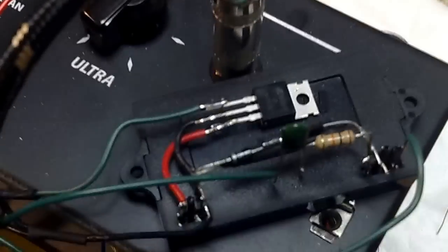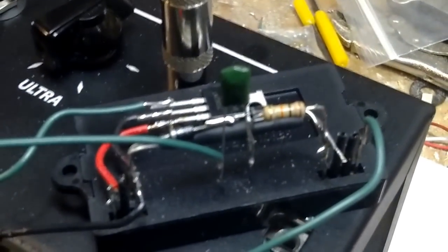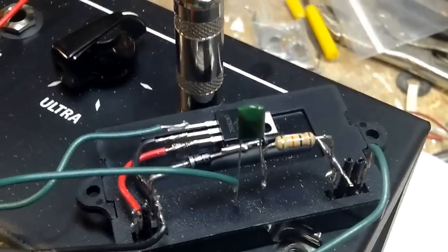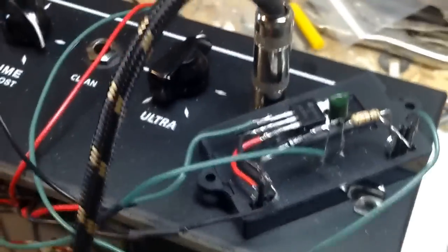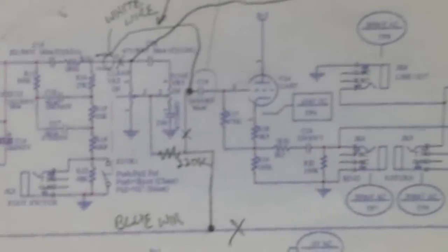Along with some of the information that was on there, I decided to give it a shot. One important thing to note, aside from using that 7805 regulator, is the input signal has a maximum of 1.5 volts. Wherever you put that in the amp, you need to make sure it's less than that.